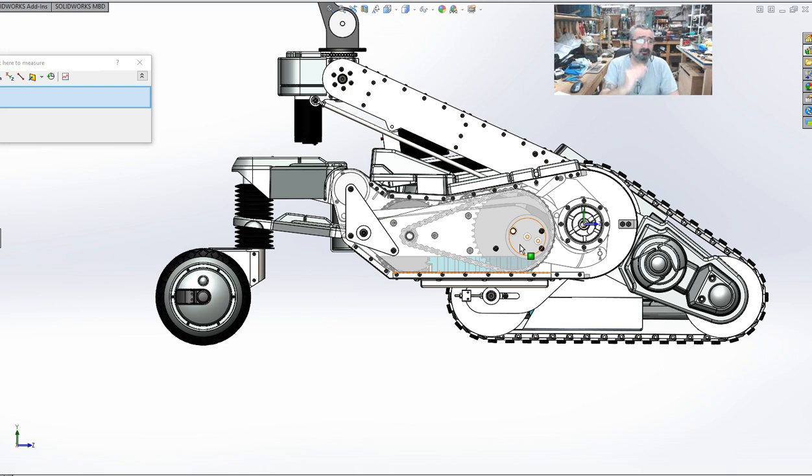And the actuators that are needed to do it in the amount of time we need really aren't made. To use an actuator-based design, you need to move 1 inch per second, because it's about a 4-inch stroke. And you need to do that in 4 seconds to be screen accurate. And you say, oh, okay, not a problem. 4 inches, 4 seconds, no problem.